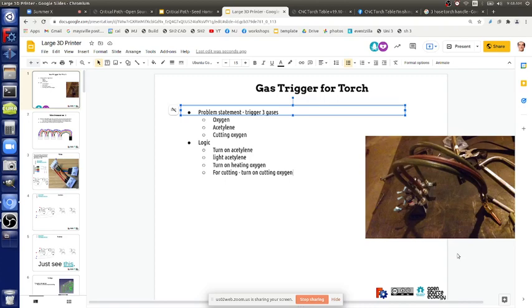I think it's altogether more expensive than acetylene. But the thing that gets you is you can only cut so much with a plasma. You'll be good for up to an inch, which is good for most purposes, but it will be slower, and the machine to do that gets pretty expensive. To do 1 inch, you're getting into like $5,000 plasma cutters. $1,000 cutters are going to be like half inch easy.